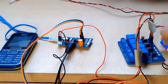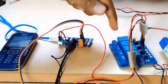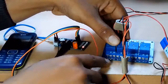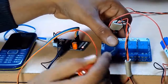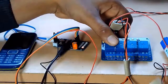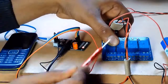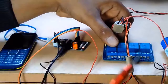To control the appliances, since relays are electromechanical switches, we have to connect our appliances to the output port of the relays. For one relay there are 3 outputs: one is common (the middle one), the right side is normally closed — meaning it is a short circuit to common when the relay is not operating. But when the relay gets a control signal and is energized, the lever disengages from the right side and engages with the left side, so the normally open one gets closed and the previously closed one becomes open circuit. We will connect all our devices in normally open mode.